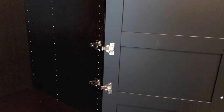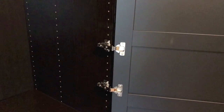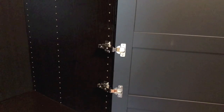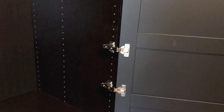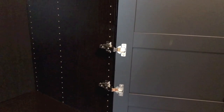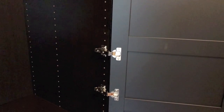All the pressure is now on those two middle hinges. At this point, I recommend a second person to assist you as you remove these hinges — you want that second person holding the actual door, because if you try to do this yourself, this is a heavy and tall door. A couple of things can happen: number one, you can drop the door and scrape or gash it.